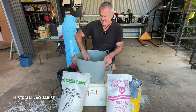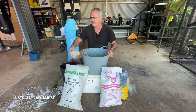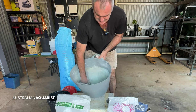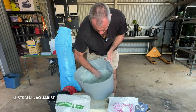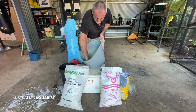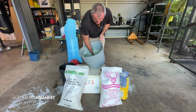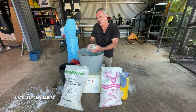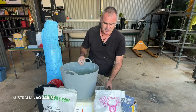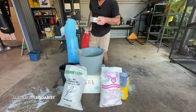The ratio is two parts perlite — I've pre-moistened it to reduce some of the dust — one part fine shell grit, and one part cement. It's important to give this mixture a good mix in the tub before you add any water. I've seen recipes with a ratio of up to 4-to-1 and even 5-to-1 aggregate to cement, but because I'm using a fairly lightweight material like perlite, I want a somewhat higher ratio of cement — so I'm using 3-to-1 aggregate to cement. The proportionally larger amount of cement creates a bit more strength. So the ratio is 3 parts aggregate, 1 part cement, 1 part water.